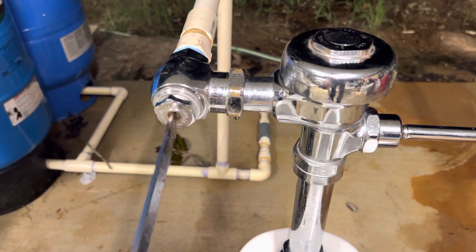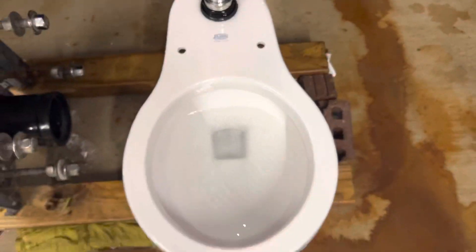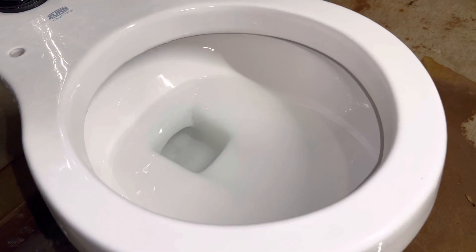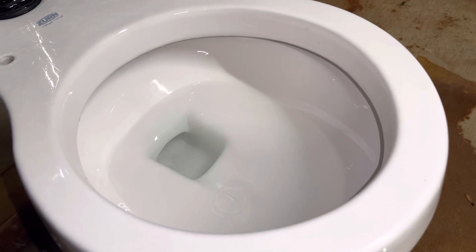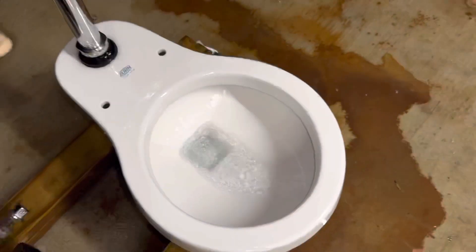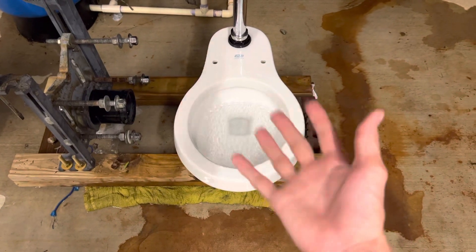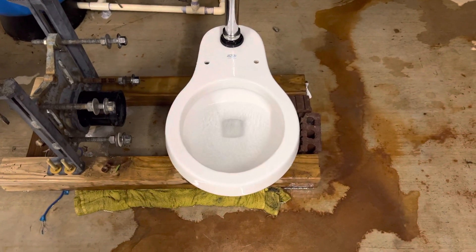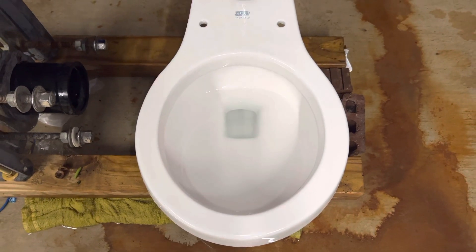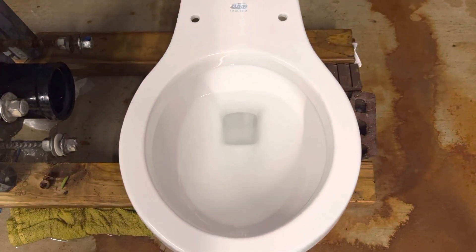Now I'm going to turn it up all the way. This flush is actually extremely powerful and it doesn't really splash out too much, which is honestly surprising to me. I'm going to do a close-up so you can see the power of the bowl rinse. As you can see, that is very powerful. I actually tried to siphon this toilet — I tried to plug the bottom, let it overflow, and unplug it, and it literally will not siphon. You have to either directly pour water really fast into the trapway opening, or plug it, let it start to flush, and then let go of the outlet to let it siphon out. Here is another flush.